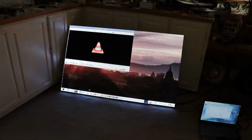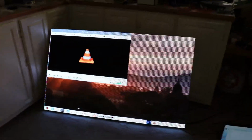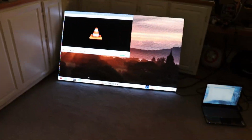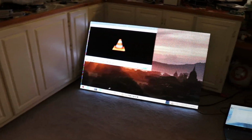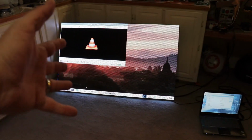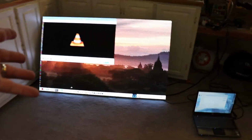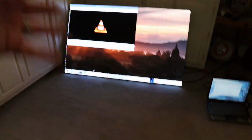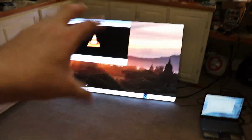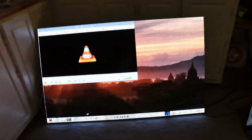Once you get a good display going, you can pretty much just play around with it until you get things absolutely perfect. Anyway, whatever resolution that you set is the resolution that this thing will do. So if you change up resolutions on the input, you'll have to go back into your software and change your resolution and your scaling factors to scale it back correctly for the new resolution. That's pretty much the video wall.